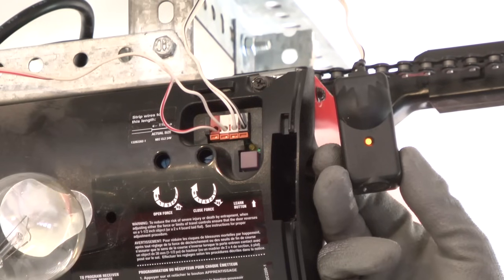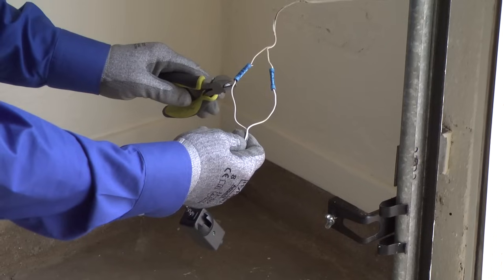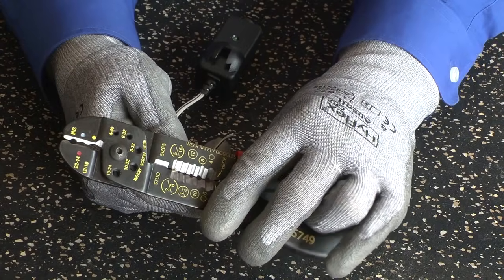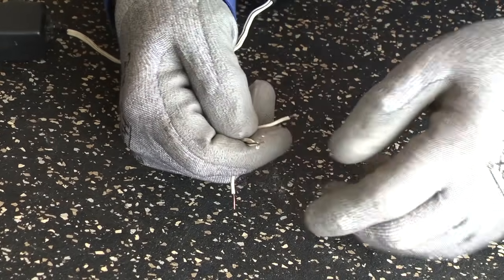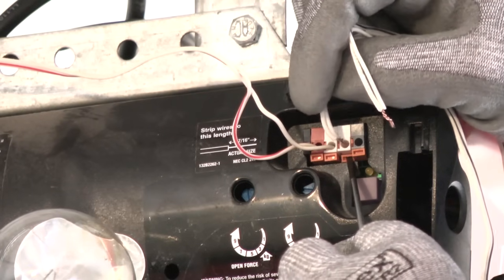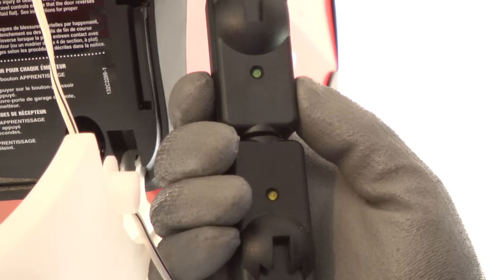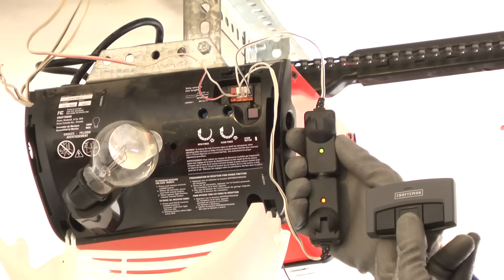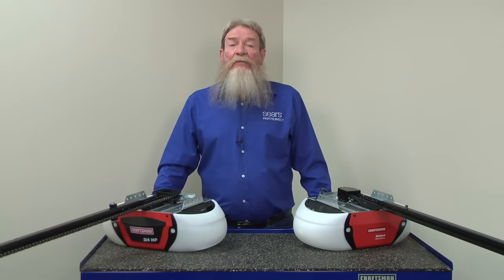If the yellow light turns on, then you know that the sending sensor is okay. Now we'll add the receiving sensor to the test. Remove the receiving sensor from its door rail bracket and disconnect or cut the sensor wire about one foot from the sensor end. Separate the sensor wire strands and strip one half inch of insulation. Disconnect the sending sensor wires from the motor unit terminals and twist the white strands with black stripes together. Repeat the process to connect the white sending and receiving sensor wire strands together. Connect the white wire strands to the white motor unit terminal and the white and black strands to the gray motor unit terminal. Hold the sensor eyes directly together and check the lights. If one or both of the lights fail to turn on, replace the safety sensors. If both lights turn on, press the remote button. If the door closes, then the safety sensors are okay. Once you've eliminated the sensors, you know the problem must be a break in the wiring.